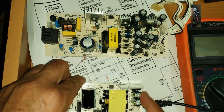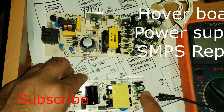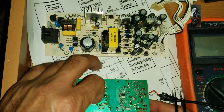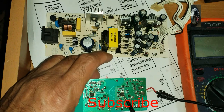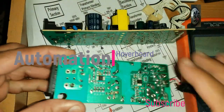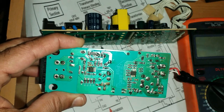Another easy method: after removing the optocoupler and fitting the diode, power on for just a few seconds then remove power. Touch this area — the diodes, capacitor, and resistors — and find which component has heated up. Change that heated component. After changing, if you are still getting more voltage than desired, the problem may be this IC — LM358 — used for PWM control. This is the complete power supply for the hoverboard. You can repair it like this. For the other side, I have another detailed video. Thanks for watching, please subscribe.